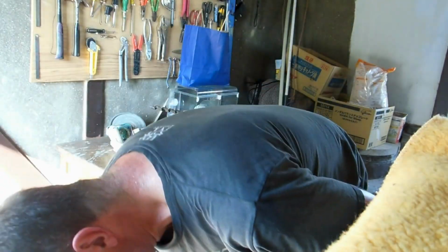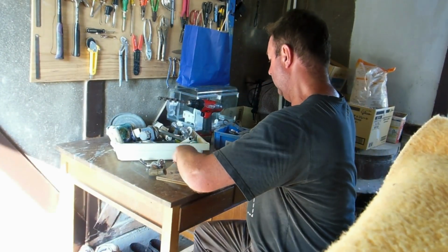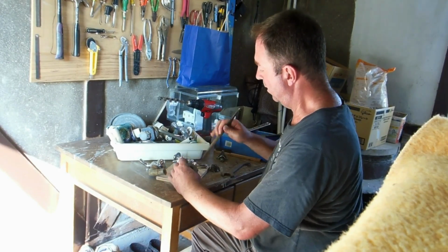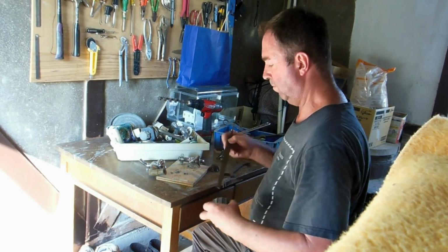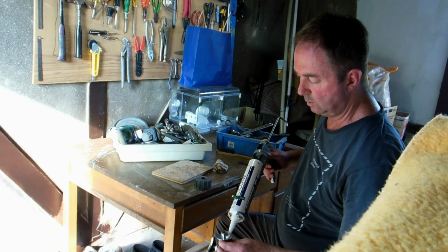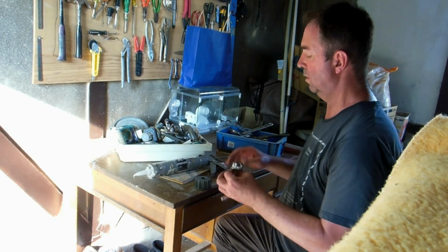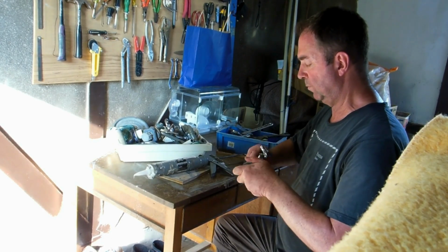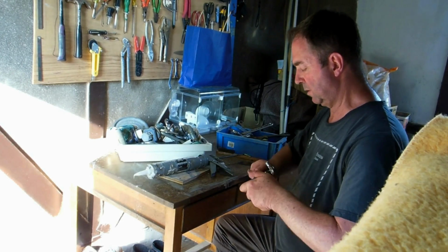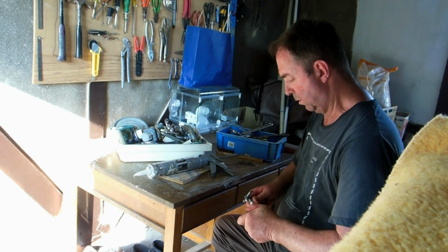And the actual plan was to put a backing on it so to hold it in. But as it turned out, made the hole just big enough for the tap to be threaded in. And the tap actually threaded in to the cap because it's made of fairly thick plastic. And ended up just screwing it in and it stayed in, so that was fine. So put some silicone on it first and some plumber's tape around the thread and then just fed it in. And it worked, went in really nice and tight. Done.